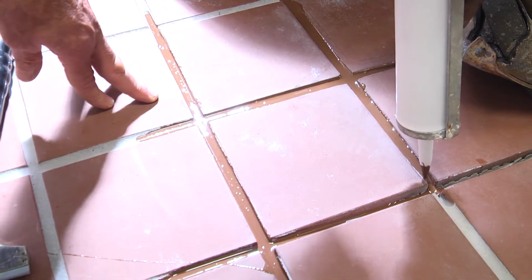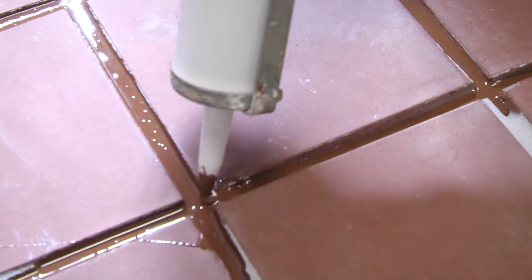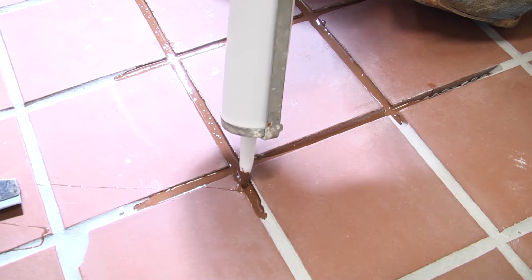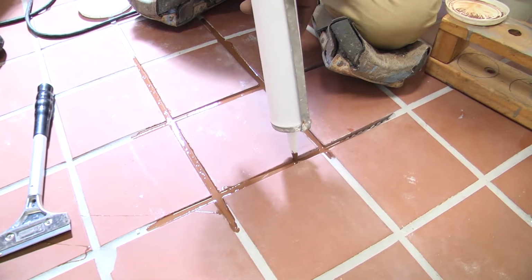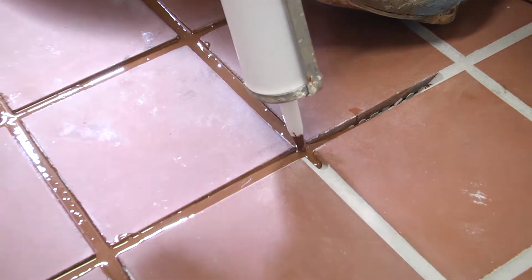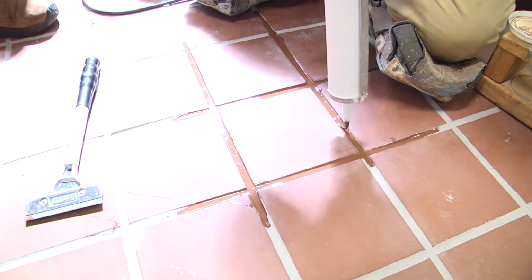Again, it's 100% solids versus a water washable epoxy. Whoever you have that installs this, it'd be good if they have a very good hand, like a painter does, a very steady hand. As you can see, the material can't run anymore, so it's at the right level. We've only cut so far, and he's just squirting in to fill in the areas now, to level it off. And the cure time on this is 4 to 6 hours at room temperature. And again, something like this you could wipe with a towel that has acetone on it. This is going to cure, it'll be at this level, it's nice and level now, and we didn't use the masking tape on this side.